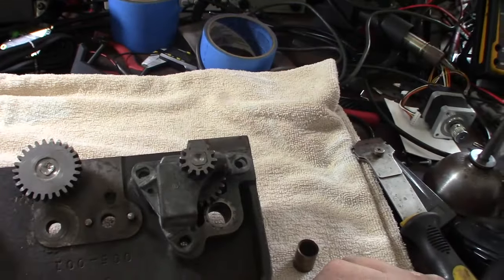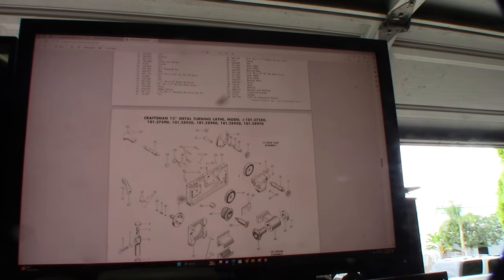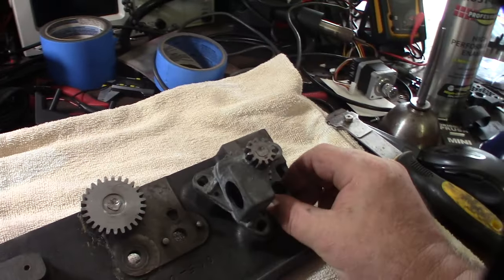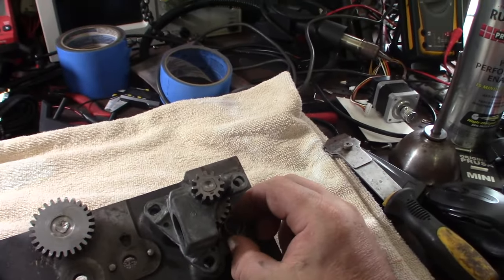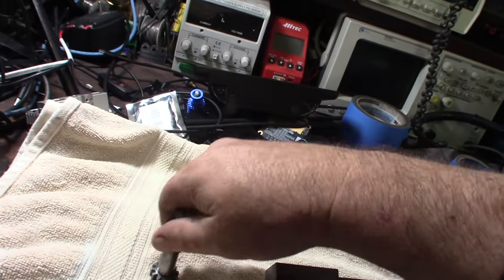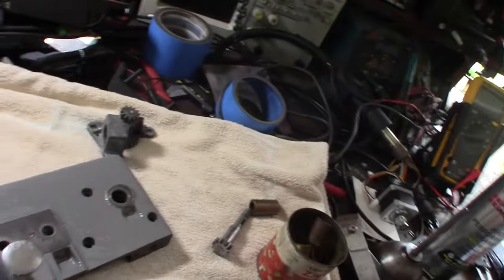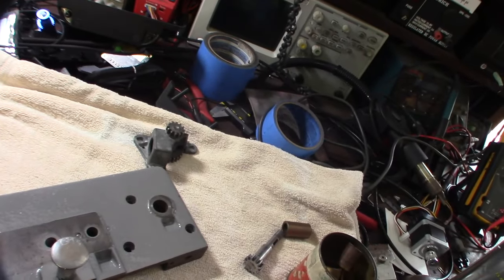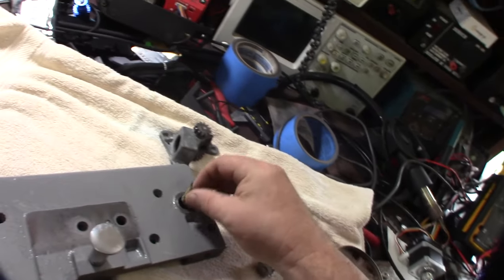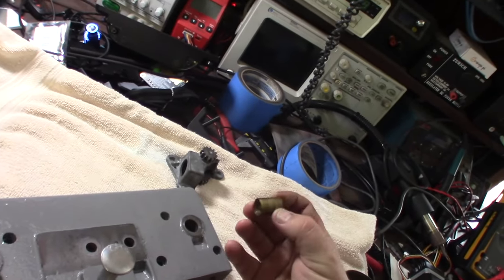So now I think I know what's up. This was actually spinning in the hole like that, and because this thing is too tight to even spin on there, it was just pushed on there. I'm going to have to come back at this — I'm definitely going to have to fix this before I put it back on. I mean, I have a boring head, I could make this bigger. I could try finding a longer bushing or custom cut one.